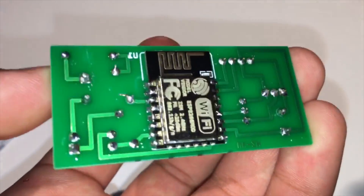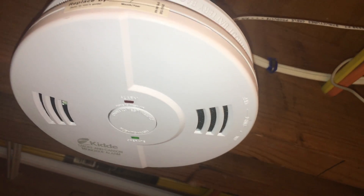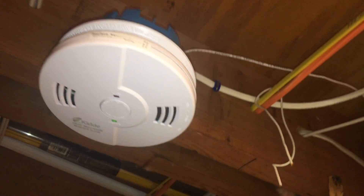Let's talk a little bit more about the fire detector and how we connect to it. If we take a look at my fire detectors you can see that there are 3 wires coming out of it, because this is a hardwired fire detector with battery backup. These types of fire detectors feature something called interconnect — if one fire detector goes off then all the fire detectors connected also go off. So what my device does is it pretends to be a fire detector and receives the signal. In past videos some of you mentioned wanting to know more detail about how the hardware works, so I will try to explain how the fire sensor works.